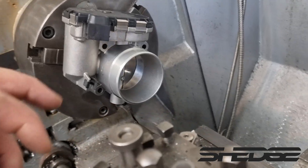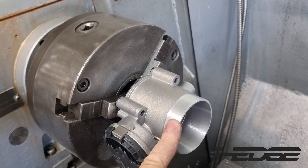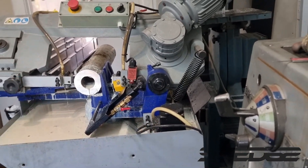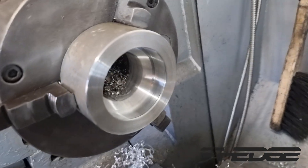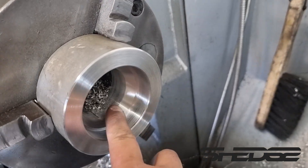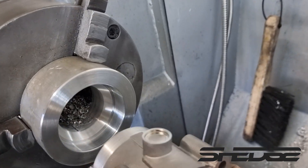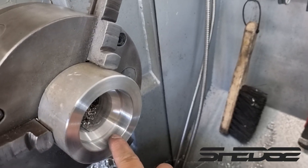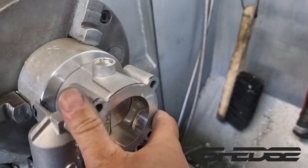What we're about to do now is part this little ring off. Just finished machining that ring off, put a little 45-degree chamfer on, got the bandsaw cutting the billet. Once that's done we can start machining the other end. We've done the inlet side - a nice taper for a smooth transition, same size lip as the tube. All we need to do is machine the o-ring grooves, but I can't do that until I know what size o-ring I can get locally.